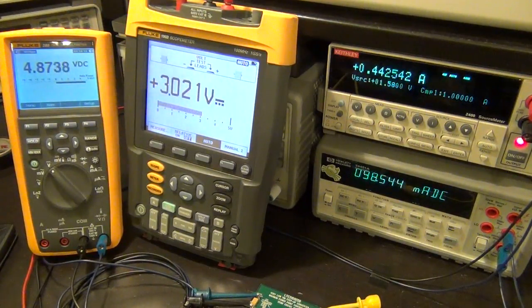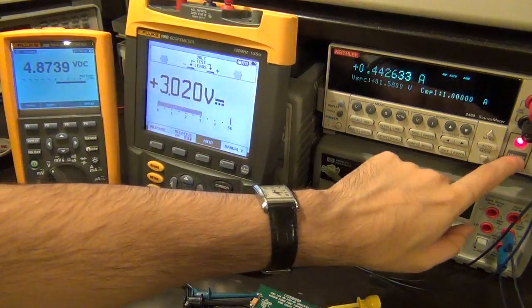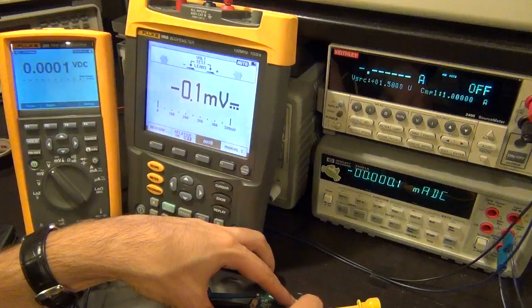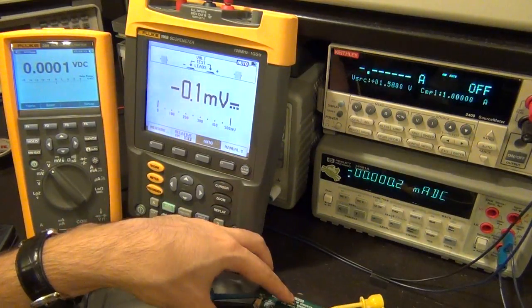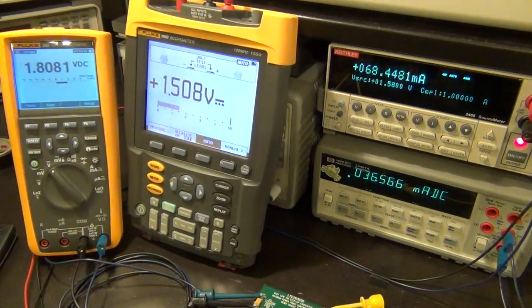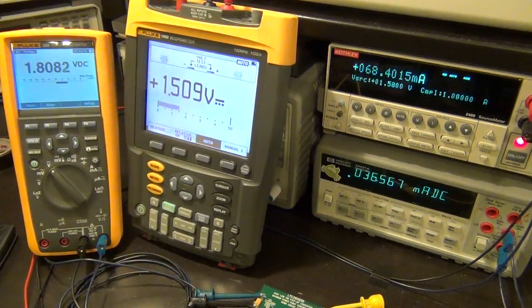The voltage can go above and below the regulated voltage, I can change the voltages and regulate them to anything I want. Right now I'm at 4.8 volts. I can even regulate 1.8 volts for some applications, and in the other output I can regulate 1.5 volts. If you have a low CMOS application, turn it back on - 1.5 volts, 1.8 volts, no problem. It works really well.